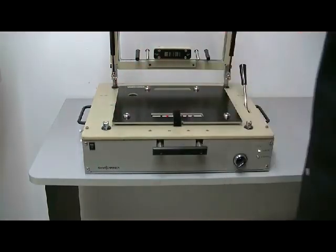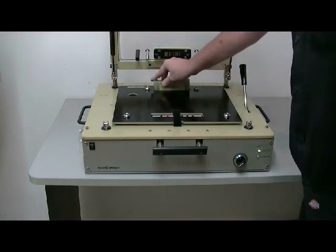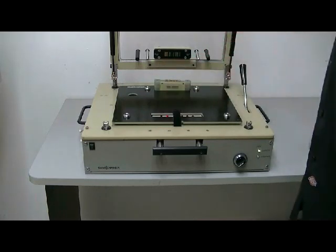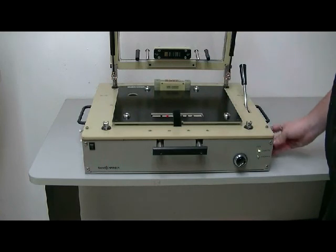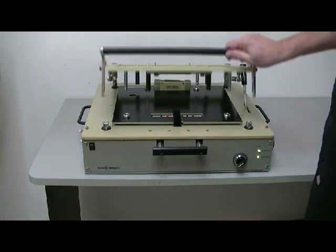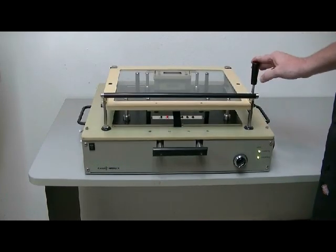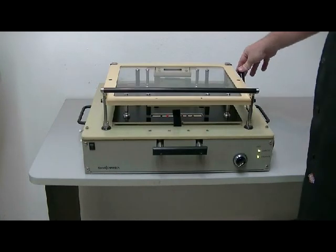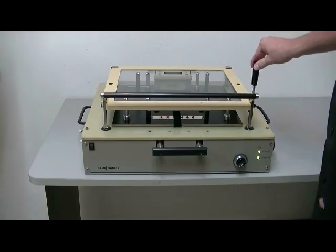The two advantages of vertical travel is that it creates the highest level of topside probe to pad contact accuracy for any double-sided test application. But equally important, vertical travel is the best solution used to minimize stress to the components on a circuit board during its test cycle. The advantage of using cassettes with a docking station is that all single and double-sided boards are tested to the same high level of quality.